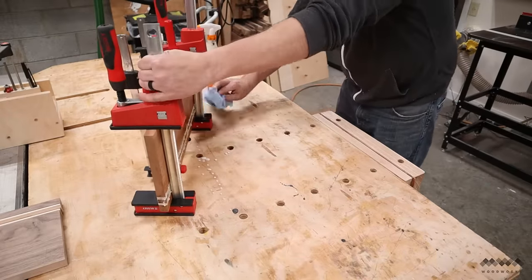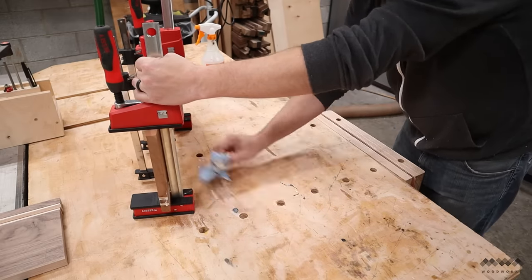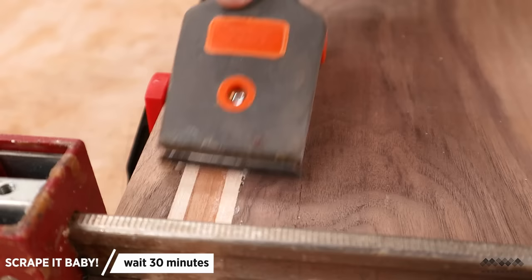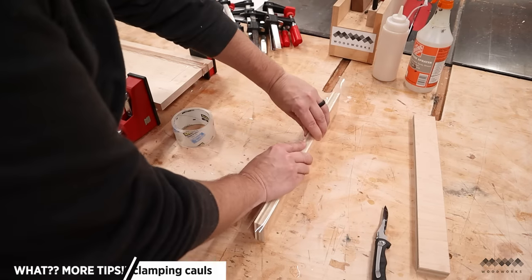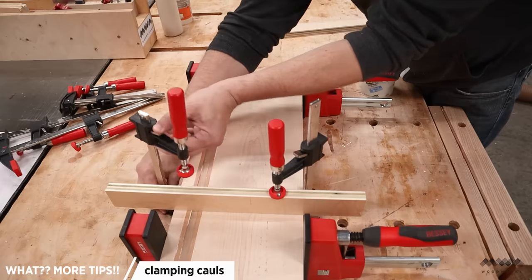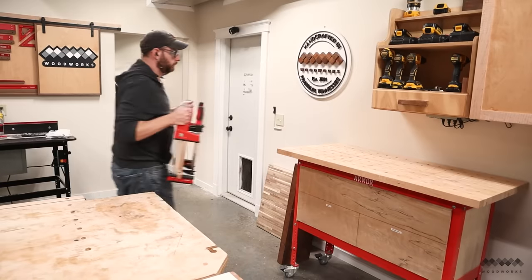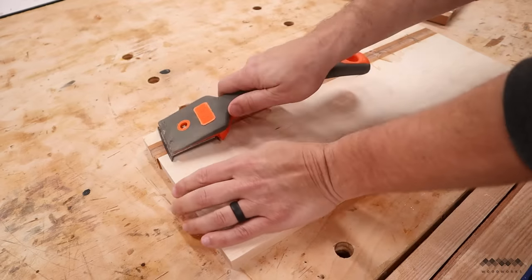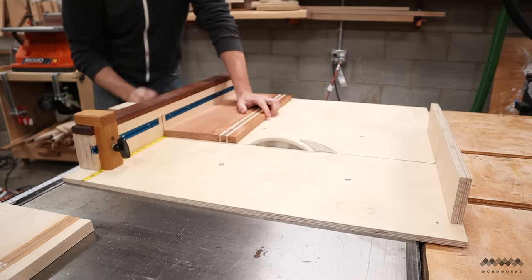One way to check your joints is to clean off the excess glue now — a little water helps with this so you can see clearly if all your joints are tight and in line. You also won't have a ton of glue to sand off later. Another trick: once the glue sits for about 30 minutes, grab a paint scraper and run it along those glue joints — the glue comes off pretty cleanly. To help ensure flat boards, use clamping cauls — strips of plywood with packing tape on one side to prevent sticking — clamped at each end before you clamp the board together. Give the boards at least eight hours in the clamps, typically overnight.